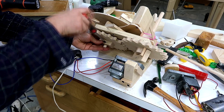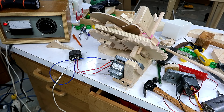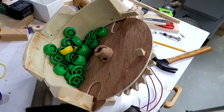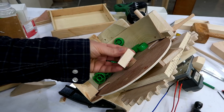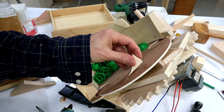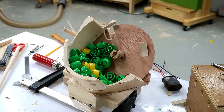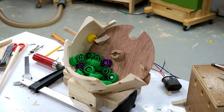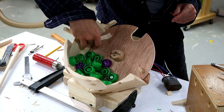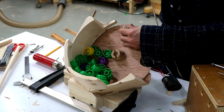I'm still disappointed with how many times these slots come up empty. I'm thinking maybe I should change the shape of this agitator to flip those caps around a little bit better. I'm hoping this ramp will flip more pieces. I got a problem — this ramp is just the wrong distance here, where you can jam a cap in there. So let me pry this off and re-glue it somewhere else, closer to the edge this time.